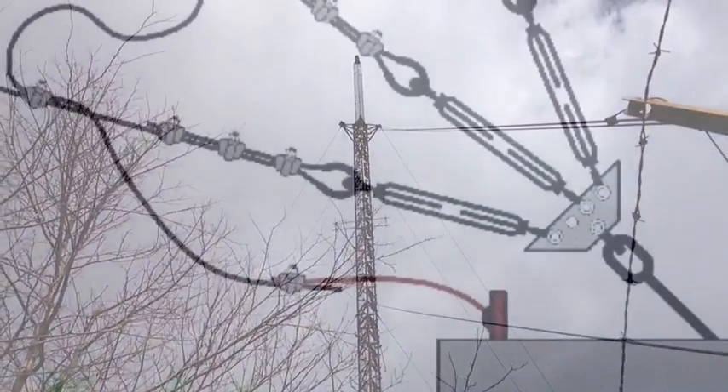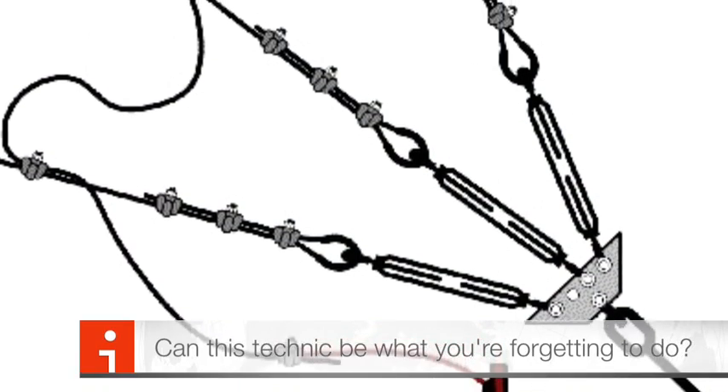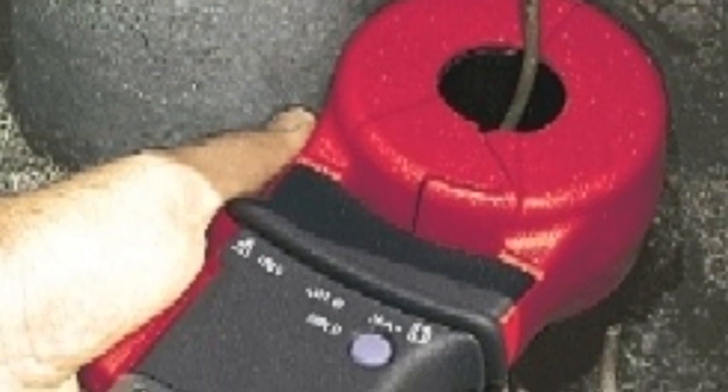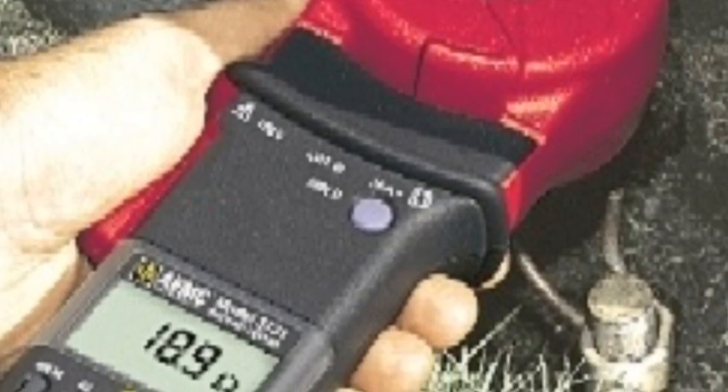Let's take a look at a picture of how that guy grounding system is. As you can see it's a little bit simpler — a picture of how they grounded the guy wire. Of course, you certainly want to take an impedance reading; anything under 20 ohms provides you a good ground system.